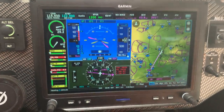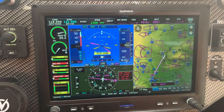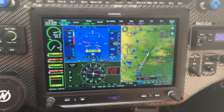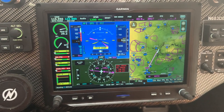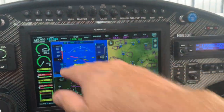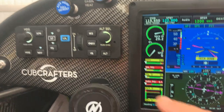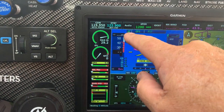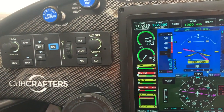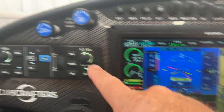You can graphically edit the route, add multiple waypoints, or use Garmin Pilot on your iPad to draw around TFRs or mountains and build the route there. When the servos sense a trim need, you'll get a trim advisory — I mostly ignore brief ones and wait to see if conditions change. For altitude, press the altitude button and it captures your current altitude — it puts in 600 feet where I am now. You can then adjust the target altitude with the knob.